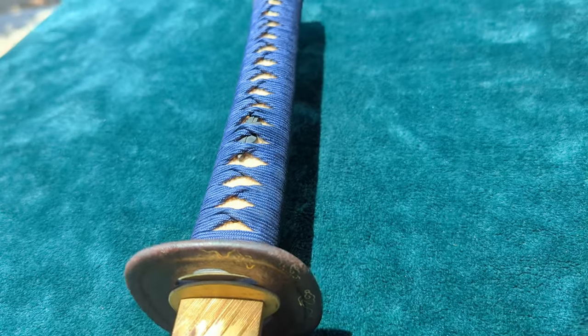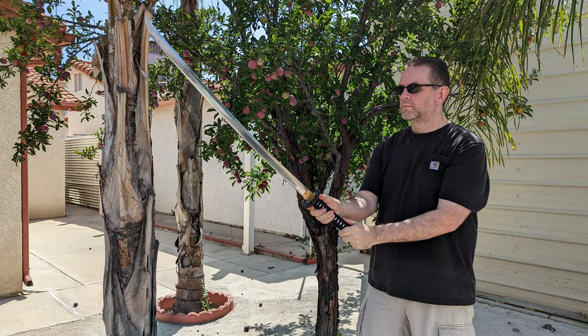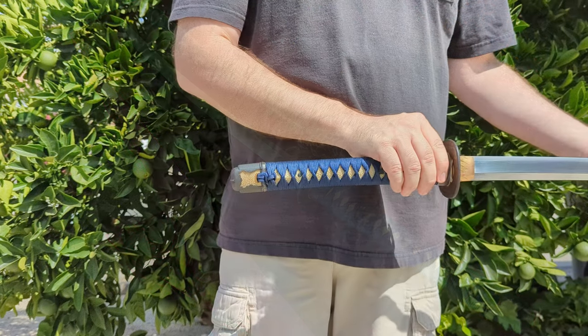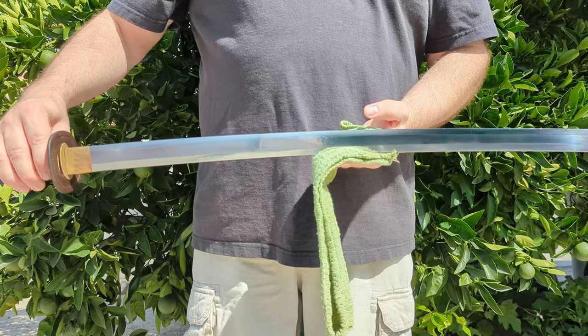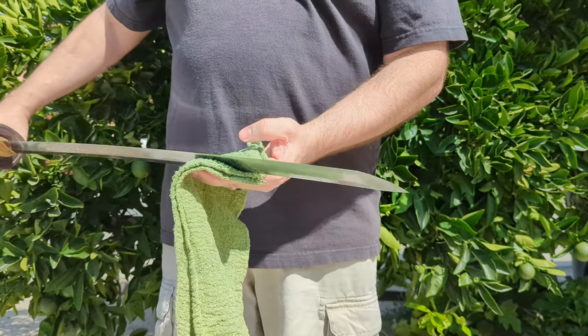So, L6, what's the big deal? Keeping in mind that I'm not a metallurgist, I'll give you a brief rundown of what I've gathered. Normally, when a steel blade is quenched, the crystalline structure of the steel is in the form of martensite. This structure produces high hardness and quite a degree of brittleness. The temper process after the quench then gently lowers the hardness a little, while considerably reducing the brittleness.